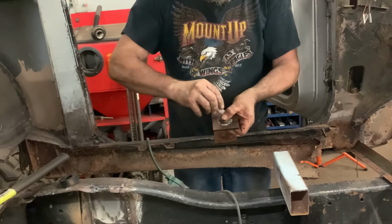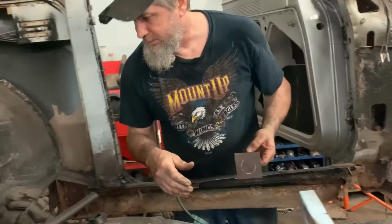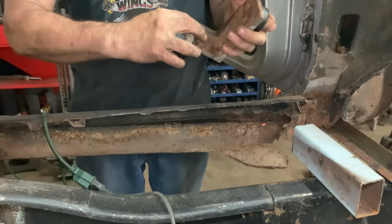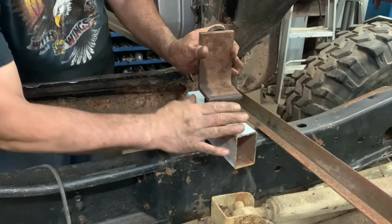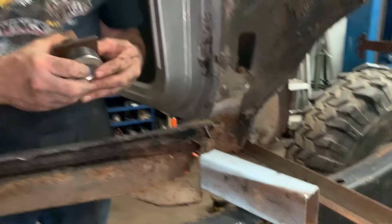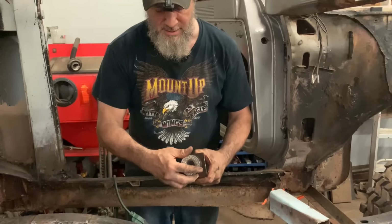Just the plan there. And what that'll do is that will take our bushing. Where's the bushing? It'll take our bushing and it will sit on top of this and go up through here and have this on top with a washer, big flat washer, bolt, going clear down through this piece. So that'll be our body mount. But we need a hole that size cut in there.